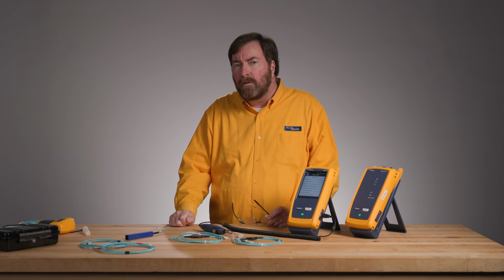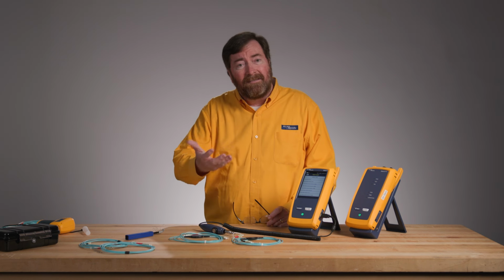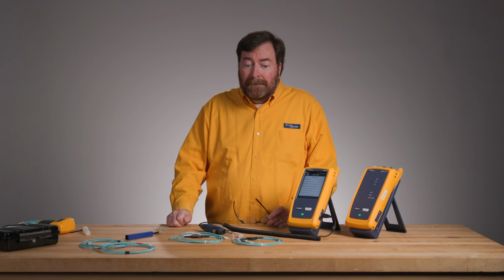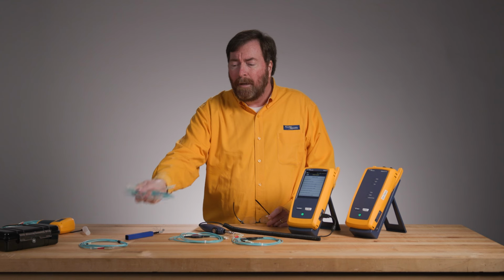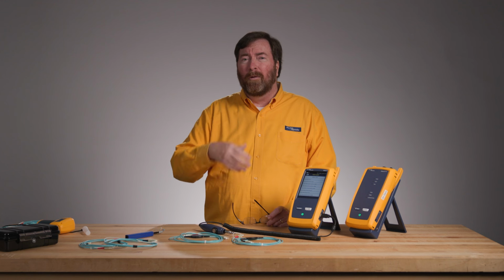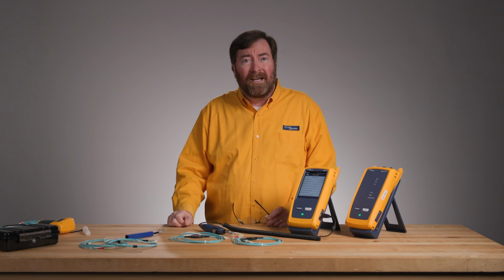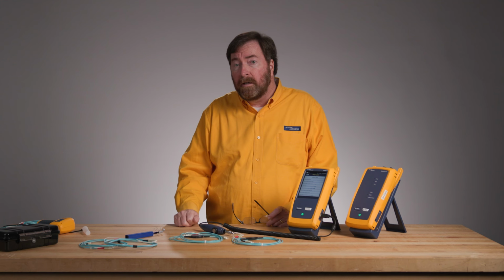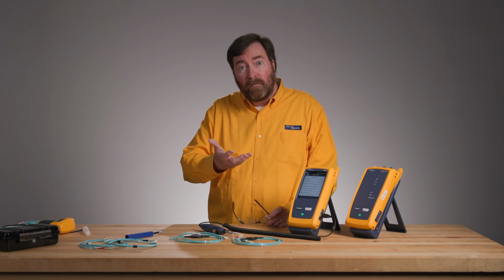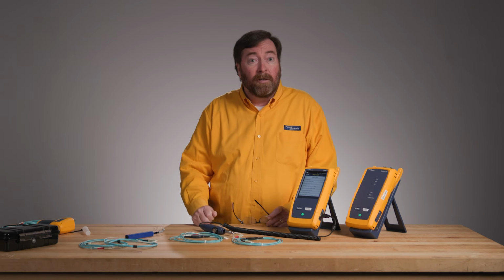and then we're going to see another very useful part of edition 3. We're going to try to clean the dirt off, but the fiber is going to continue to fail. It's simple to replace a single fiber optic cable, but if I've got an array connector and I've got 12 or 24 fibers and I've got a 144 or a 288 trunk, I hate to send that back to the manufacturer being defective if the contaminant doesn't affect the light. So the new edition 3 limits are going to say if the optical performance is acceptable, then the optical performance will override too much dirt on the end face.